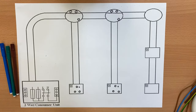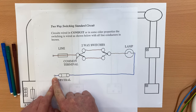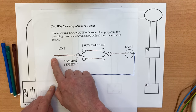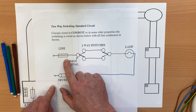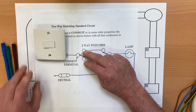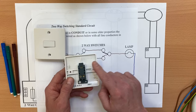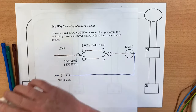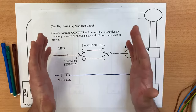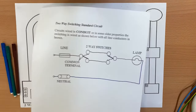The CPC terminal is already in there. Now we go back to our original circuit diagram. The neutral went from the consumer unit directly to the lighting point itself. The line conductor went through the circuit breaker into the common terminal. Two strappers went across from this two-way switch to the second two-way switch, and from the common of that one we went directly to the lighting point. Notice we have no circuit protective conductors shown on the circuit diagram — they'll take the shortest logical route.